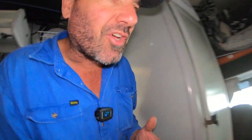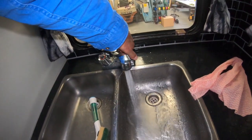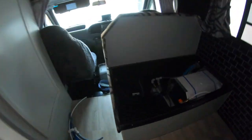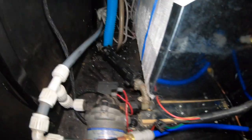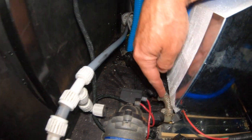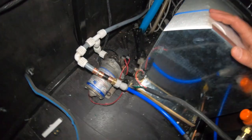The pump's quite an old one. Watch when I turn the water on - it's just a bit spluttery. See how it's spluttering like that? And then when you turn it off, that pump just keeps going and going. What I think is the issue is this retic filter on here - it goes all the way down, and we've got nine joints on that pipe. If one of these is leaking and letting air through, it'll cause an issue with the pump not turning off because there's like a bit of an airlock in there.